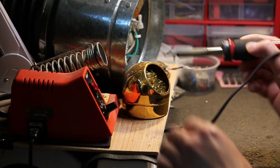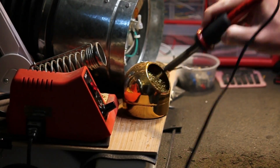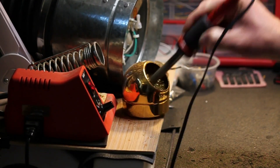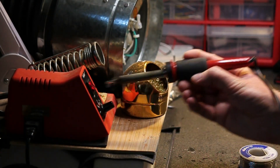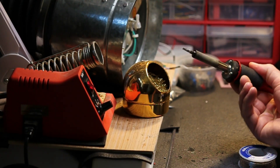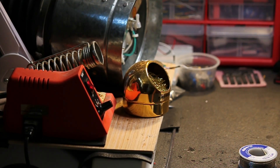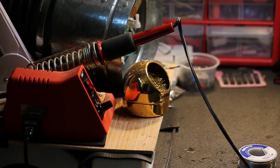When you're first starting up the iron for use, generally I would wait for it to warm up on its medium heat setting, use the brass sponge to scrub off the oxidation and excess solder, then apply a little bit of new solder to the tip, and then use the brass sponge again. At this point, the tip should be nice and shiny and ready for use. This is where the large spool of solder really comes in handy — because it has a slightly higher flux content, it can more aggressively attack the oxidation.